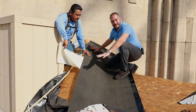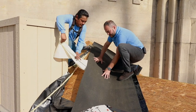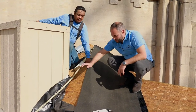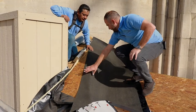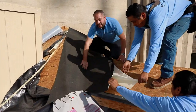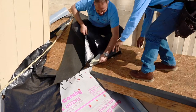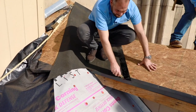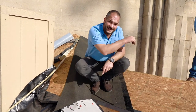We've got our ice and water shield aligned here. We're just going to take the film off and start pulling it. You don't have to flap it back — you can just pull it like this, and as easy as that. If you don't lift it back, you don't lose alignment. So just pulling it off here, you can tap it into place and make sure you're properly adhered. We're going to do the same thing on this side — just grab this film, making sure we don't lose our place in the valley. We've cut flush with the drip edge and have a nice snug corner, ready to install the other side.